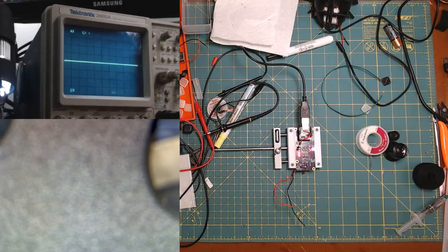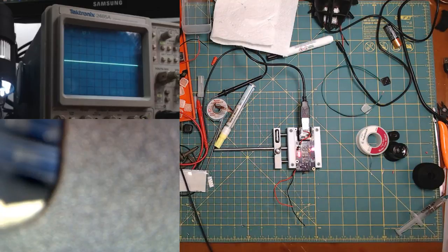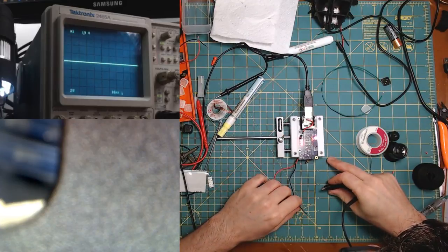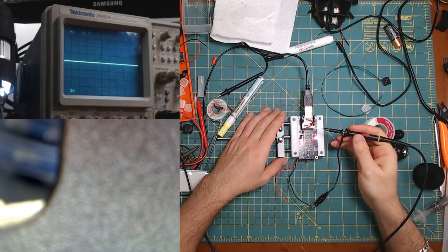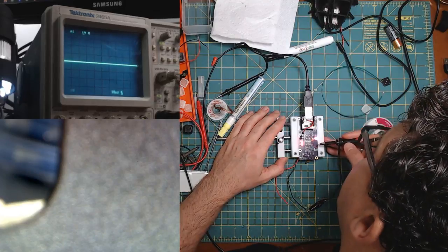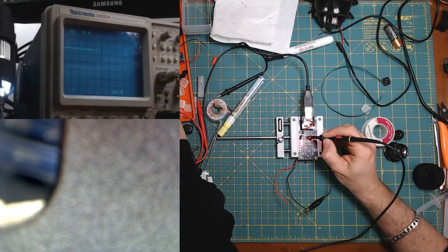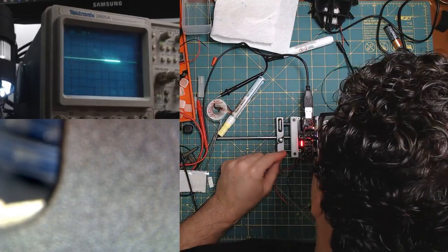So, all right. Oh, God, there's a bunch of stuff on the floor here. Let's clean. Okay. So this is similar to yesterday, except I just need to find where to hook up my probe. So there's two signals, a clock and a data, and hopefully we should see one of them appear. I believe this should be the clock. There we go. So if I change the scale, that is not the clock. Is that the data? This is a CL.